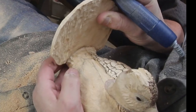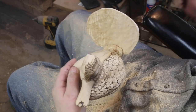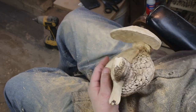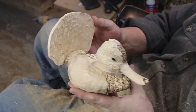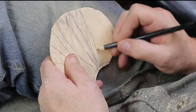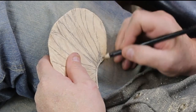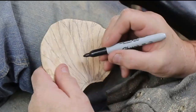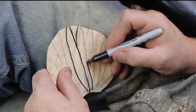So this is where I took a little license. I cut the blank with the grain running from the tail to the top — this one will have a tendency to chip like the other. I put a groove in the back and glued it in. The tail is not carved down to match yet; the easiest way is to do this before I stick it in. Here I'm laying out the feathers — in the center you'll see one full feather, and then the feathers on the left and right are only partial.